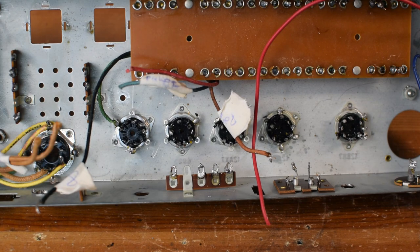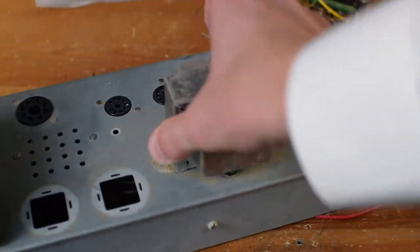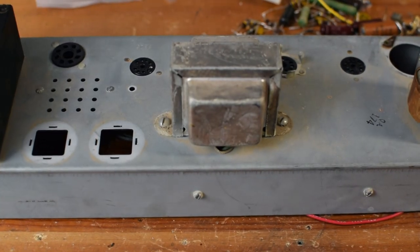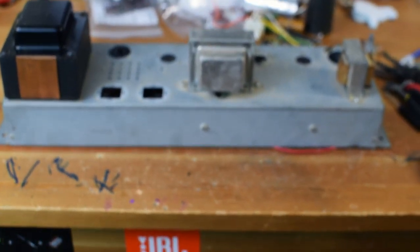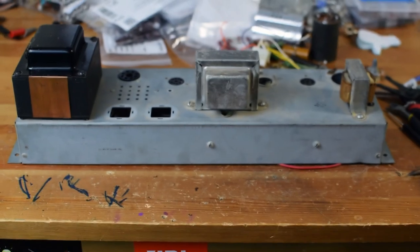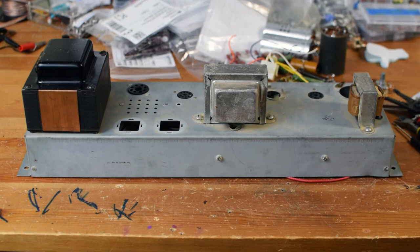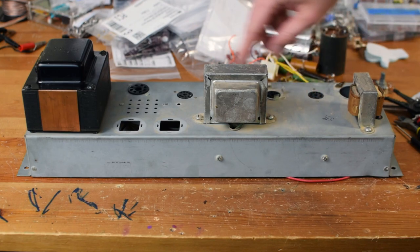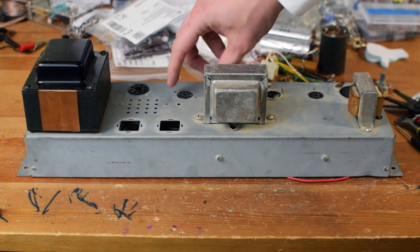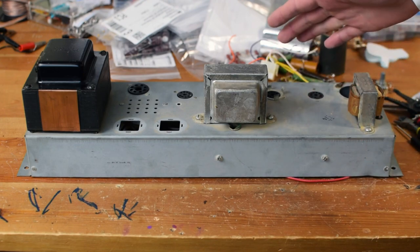Now, the next thing I'm thinking about is getting the exterior drilled for any of the holes I'm going to need. If we zoom out a second and take a look at the exterior of the amp, I think this side is a lot cleaner and more of a blank canvas, so to speak. I could foresee that we have our input side over here, and rectifier and output tubes over here. An input jack right here running kind of straight to this tube might work nicely.